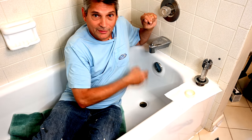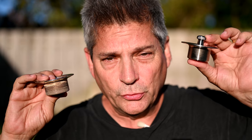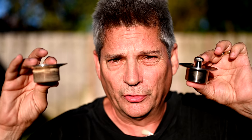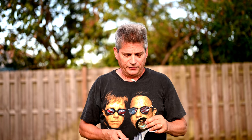We're going to show you what to do to this drain so that it looks exactly like the tub drain with the exact same threading. It's actually very easy. Don't drive all over the county looking for plumbing supply houses that might carry this part — nobody carries it anymore. The best thing to do is find the correct bushing to screw on to your new drain that will match the threads on the existing drain shoe. There are just four simple pieces of information we need.